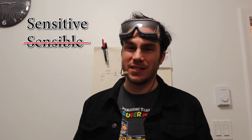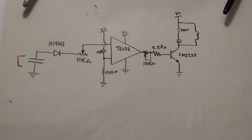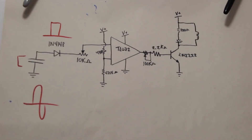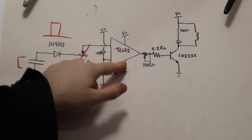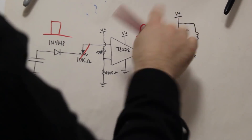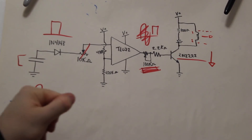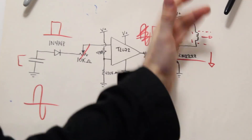I meant sensitive, not sensible. Thank you Glitch2Soft for the advice. So the piezo alone will never be able to trigger the switch in the SP404. When I tap on the piezo disc, a pulse will be produced. We just want to keep the positive edge of the pulse — this is why we use a fast switching diode. This pulse is then amplified by an operational amplifier. The output is adjusted to saturate the transistor, which will then activate a relay. And this relay should trick the switch. Will it work? Well, we will see.